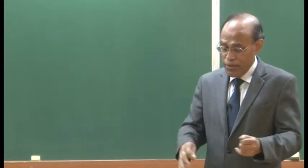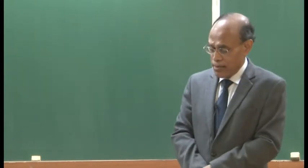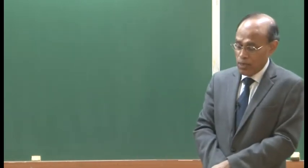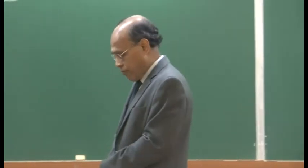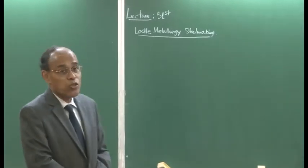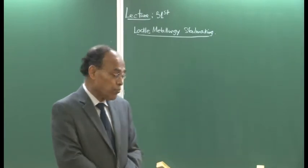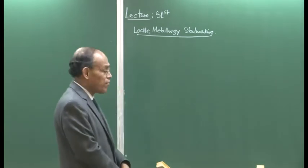And I have given you a good overview of the ladle construction, the features, and we were about to talk about heating of molten metal or molten steel. In the backdrop of 70-80 minutes of extra time required for treatment in ladle, we will have loss of heat, and already we have lost quite a bit of heat during tapping of steel, 60 to 70 degrees depending on the furnace conditions, etcetera.